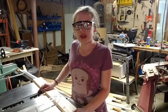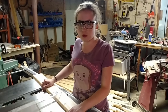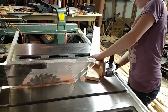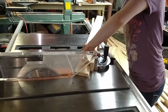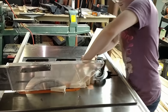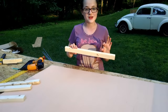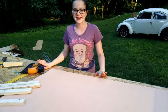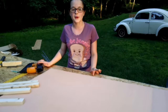I'm going to need 24 rafters, and I don't want them to be as heavy as normal 2x4s, so I ripped them in half lengthwise so that now they are 1x4 nominal. I've cut all my pieces, including 60 noggins out of 1x2 furring strips. Now I'm going to assemble my roof panels using first my brad nailer to temporarily hold the pieces in place, then with screws to permanently keep them there.